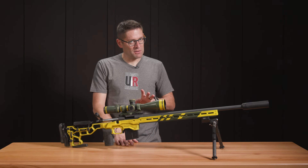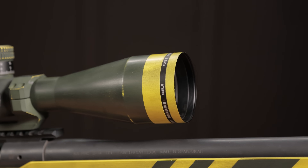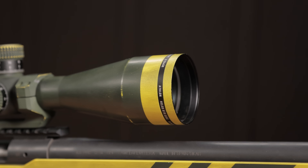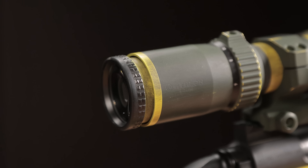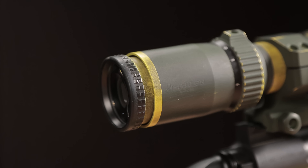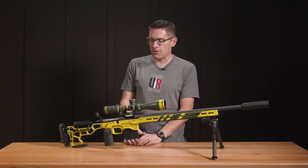It's really great to have a vinyl cutter. My trainer cut some masking circles for the lenses on either end, which was really handy — gets right up to the edge perfectly. Just use some digital calipers, measure it, and then cut to that particular diameter. Really great trick.